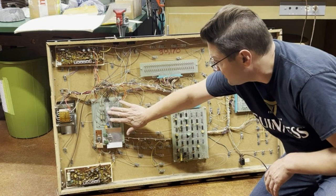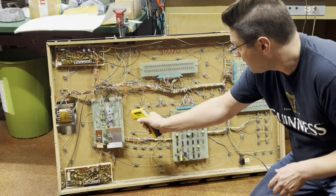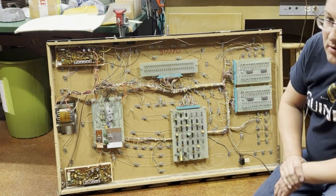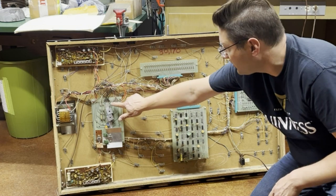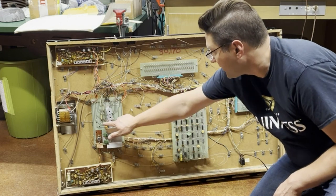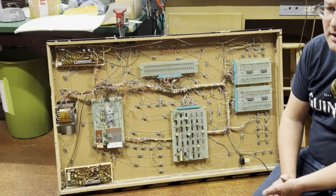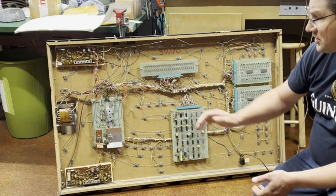I removed the huge heat sink. These components get to about 93–105 degrees Fahrenheit, which should be fine. I went from 4-amp to 35-amp bridges because that's what I had, and I replaced both capacitors and both diodes — they were 1N4001s; I put in 1N4007s because that's all I stock. They're a few cents a piece — cheap insurance, just replacing some old silicon.